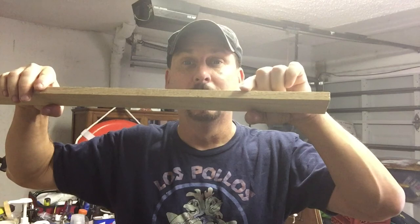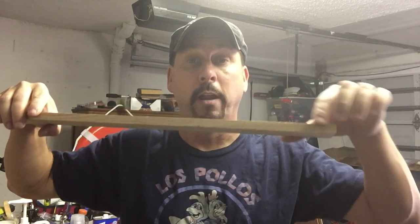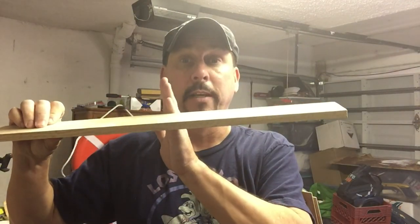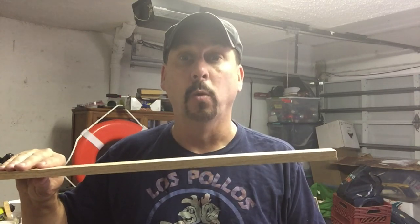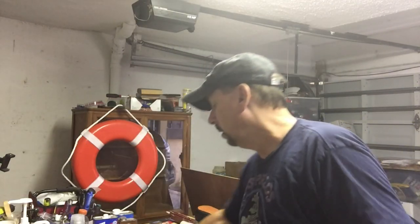I'll do probably two or three coats of epoxy. What I don't like is this edge — it might ride a little bit along that at some point, but I can also do this with chopped strand mat to build it up thicker. But really, it's seriously easily replaceable. Oak withstands water pretty well and most of the time there's not going to be much water or humidity in there anyway. Later when I put the cooling unit in to actually make it a refrigerator I'll revisit this — those things remove moisture so it'll just be cold, not cold and wet.